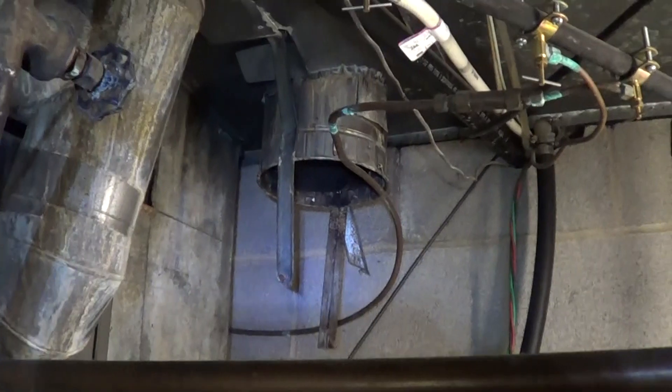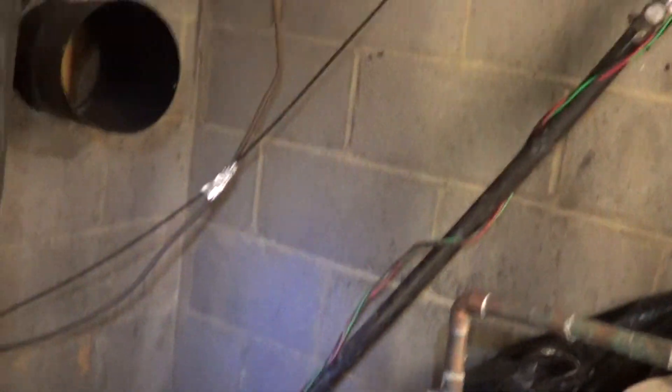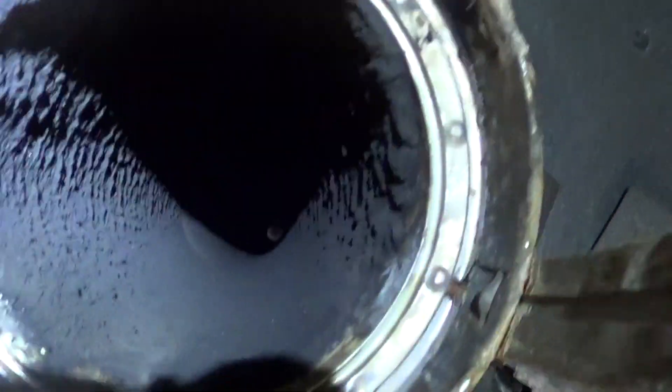Starting to pull out the old furnace, and I wanted to check the integrity of the exhaust stack. As soon as I pulled off the horizontal piece, it dumped a huge pile of soot that you can see right there - just in a little four-foot section of pipe. And up here on the vertical rise, that sucker's full too. Get the light up there - you can see all the soot all the way to the roof.